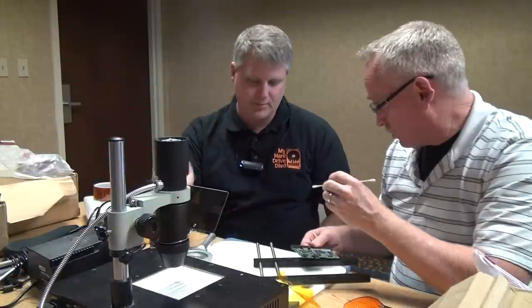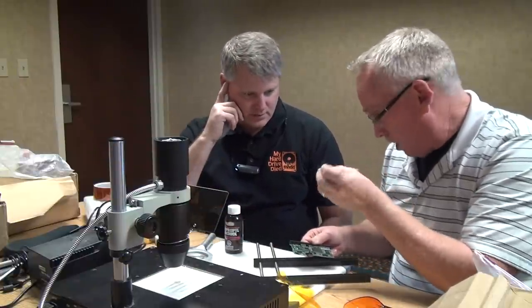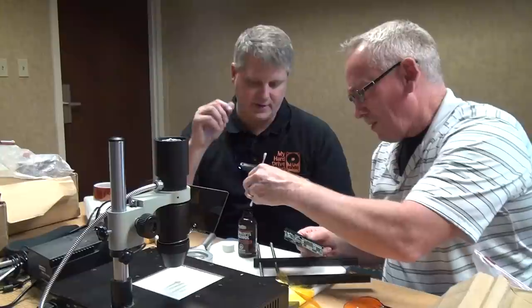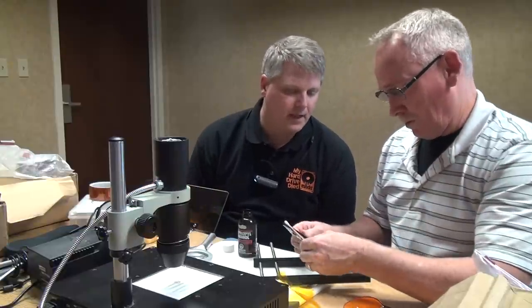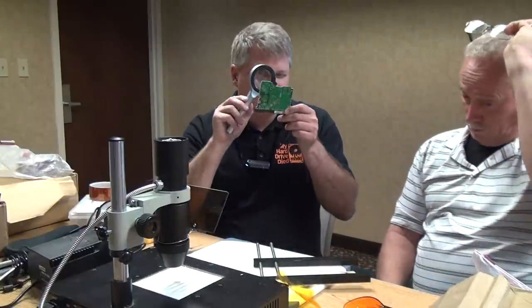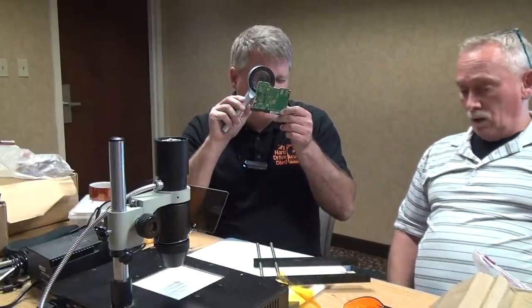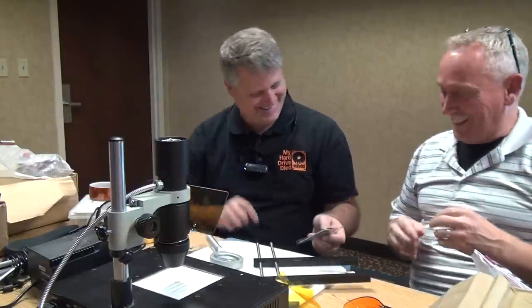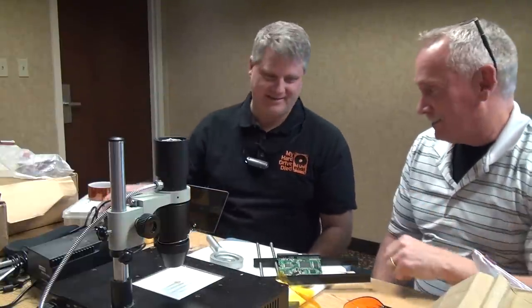The next thing is peel the tape off, then we'll use alcohol on a swab to get rid of all the flux. We don't want to leave all the flux and stickiness on there. When you're done, it would be very difficult to even tell the difference between something professionally done and this. Flux is the only way people know it was reworked, so if you clean off the flux well enough, it'll look perfect — you can't tell the difference at all. You can use tweezers with a small piece of paper towel and rub in there, and put a few more drops of alcohol to clean it up. That's all there is to it — it's pretty nice and smooth. Even with a microscope I probably can't easily tell. It's a little slanted, but all the feet line up and all the pads are there. It looks pretty perfect.